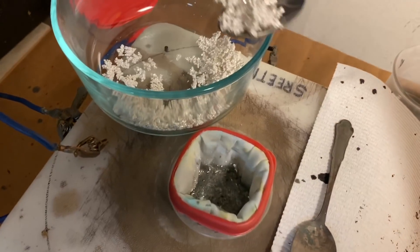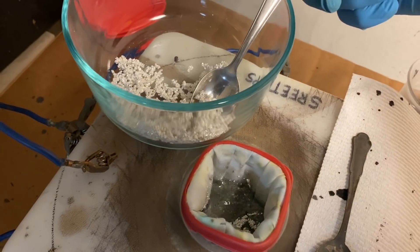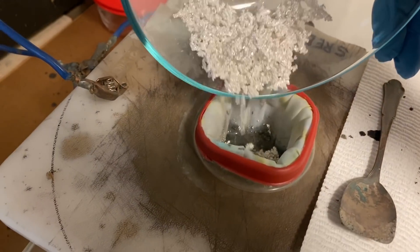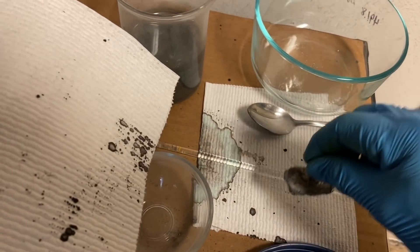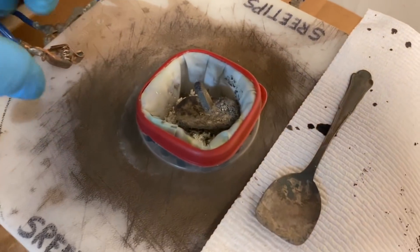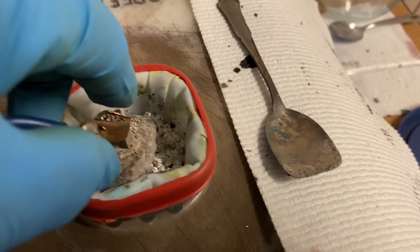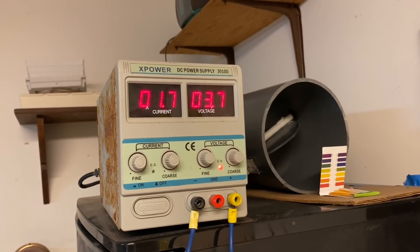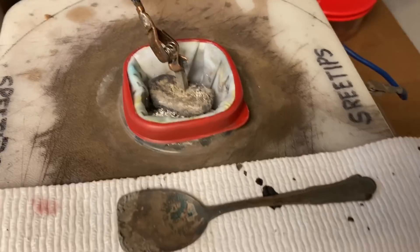I'm going to put some silver in our anode filter here. I'm running this pure silver crystal back through a second time to repurify it. Now I'm going to install the anode bar, and I've got to get busy and get some of this silver shot melted up. Now we'll turn the power on and see where we're at — that's looking good. We're back online with our silver cell.